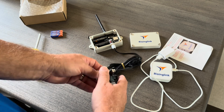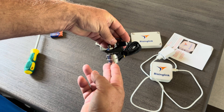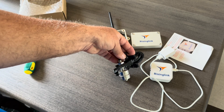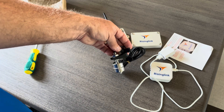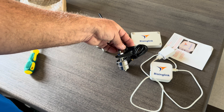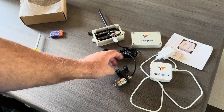By positioning this sensor — and I'll take you outside to show you where I'm going to put it — this hooks into your Wi-Fi, it's battery powered, and it mounts onto the piling. When the water exceeds a certain level and lifts the float for five minutes straight, it sends you a text saying 'high water.' When it drops down, it sends another text saying the water is no longer high. My 'just right' position is about six to eight inches below the top of the dock, so I'll know when it's reached the bottom of the dock and can react before it gets over the planks.